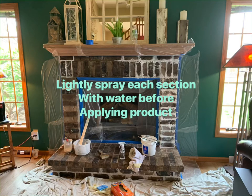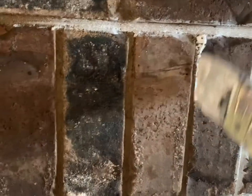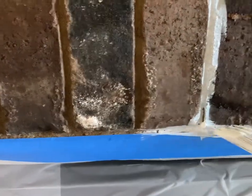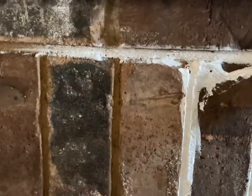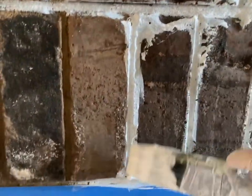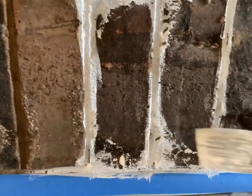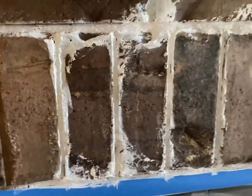Okay, so now we've gotten started on the fireplace. As you can see, we've plastic-ed it off very well. I used press-and-seal around much of it and tape as needed — you want to protect your surfaces close by very well. They recommend starting at the bottom, so we started at the bottom, though I went up the sides and all over the place. I'm using a two-inch angled brush, and that's what's working best for me on this particular job. I'm able to get into those mortar lines, and then I use the brush on its side to do some tipping, which creates the distressed look.